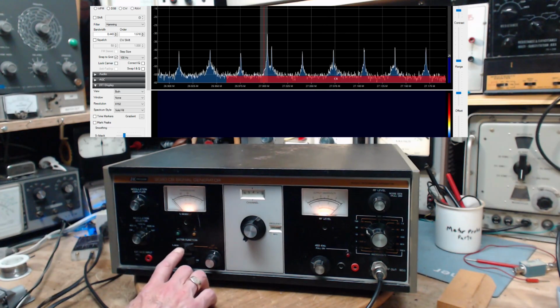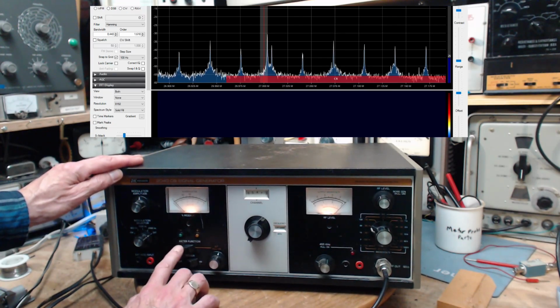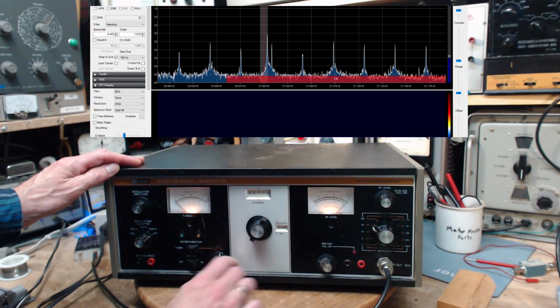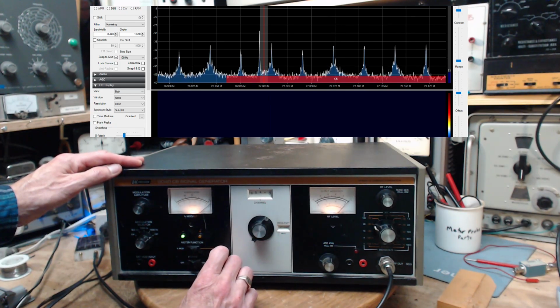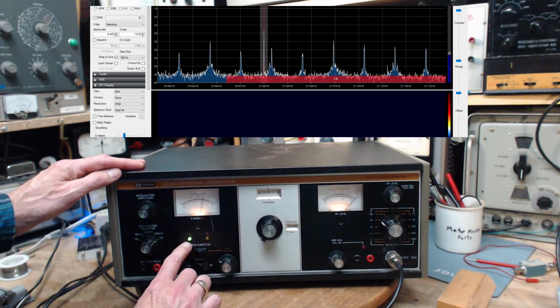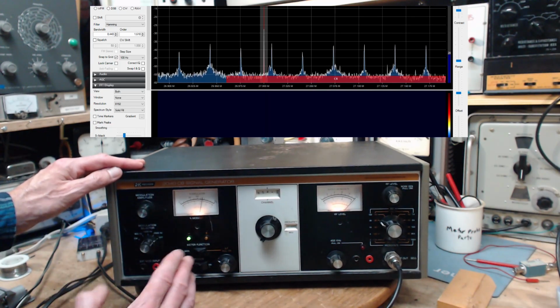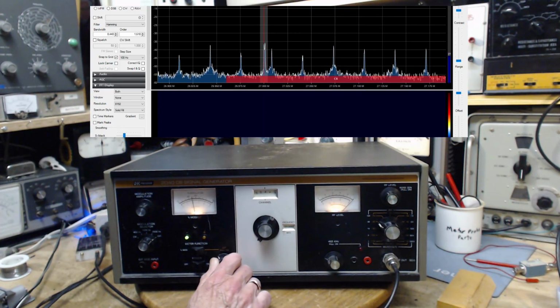Okay. So, we have no modulation. The meter's actually, I do have a little bit. The meter's set for this function. Oh yeah, there it goes, back and forth. So if we wanted to nail it according to the SDR, we would do this. Now, on the machine are a couple lights. This one has a negative sign, this one has a positive sign. It's trying to tell you whether you're above or below the frequency of the crystal, I believe. That's what it's doing.